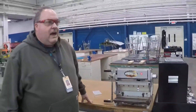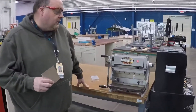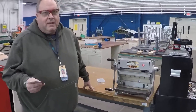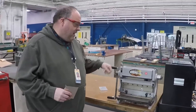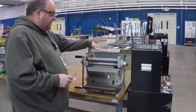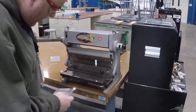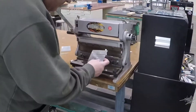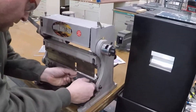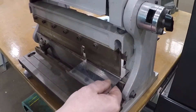This little guy is definitely not meant for thick aluminum. I actually recommend not using aluminum any thicker than 25 thousandths. If you have a small piece of 32 thousandths, it'll cut it and bend it, but this one is really meant for thin aluminum. It's got a slip roll former on there, and it's got a brake right here. I already drew a line on there, so I'm going to line my piece in there and slowly bring it down.